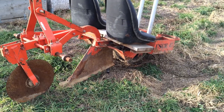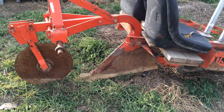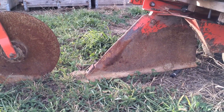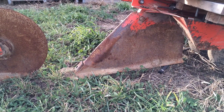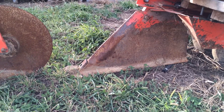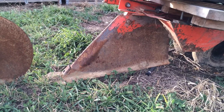It's been modified a little bit, and I want to walk through what we've done. First thing on this thing is that the shoe on it is made to dive — it tends to bury itself in soil so it can be planted into an existing sod versus having to till up a bed. That's really important, especially if you have a lower horsepower tractor. It makes it a lot easier to operate.